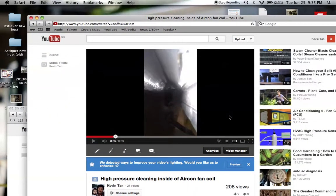High-pressure jet is very important because it is only with this high-pressure jet that the water actually gets pushed through the fan coil. With our cleaning method, which is a patent-pending cleaning method, not only do we have the high-pressure jet that cleans the front of the fan coil — with a specially filed pattern for the high-pressure jet nozzle, we are able to clean the inside of the fan coil from inside out.